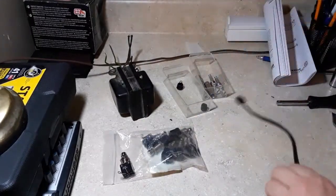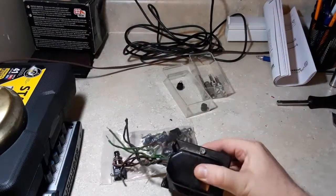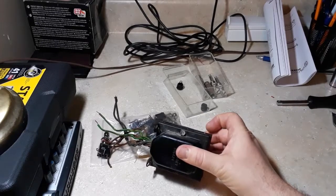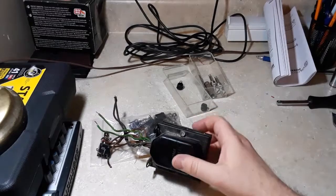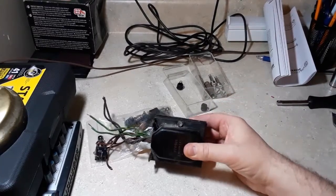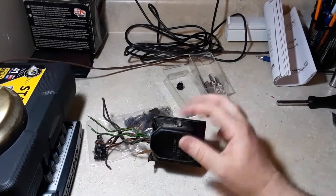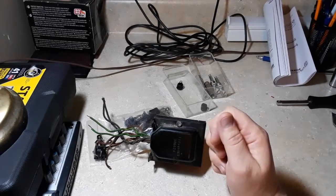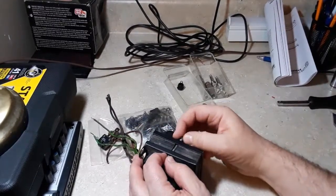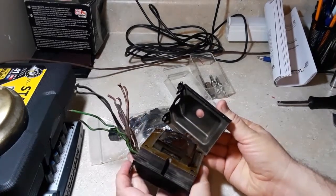So first of all, these are going in the garbage can. As I was looking around, I found this power transformer — this is off of an old, probably 1940s Motorola radio. It came to me in really bad condition. I decided I didn't want to do any electrical restoration on it, but I just wanted to make the cabinet a lot nicer. But I had this power transformer on it; I thought about reusing it. The voltages coming out of this thing with modern AC mains at about 125 volts made the secondaries way too high — my 6.3-volt line was going up to about 9 volts, which was a little crazy. So I started taking this thing apart and noticed it looks nice and toasty, so I dropped it in the garbage can.